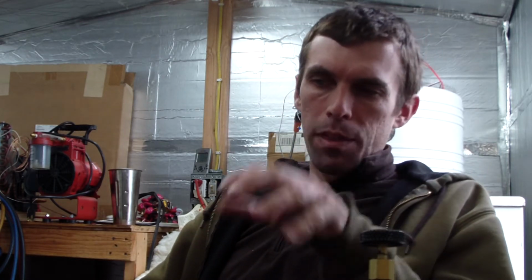This thing is a heat transformer, and we're trying to go from a high heat flux in the evaporator to a lower heat flux, much more spread out in the condenser. The problem that I see with these microfin and microchannel condensers is that I was getting a lot of, for lack of a better word, capillary action. The wetting of the refrigerant, the alcohol, in the channels of the condenser meant it was sticking and not falling by gravity very effectively. If you had something with a little bit larger microchannel, those droplets would fall more effectively, and I think it would have worked a little bit better.